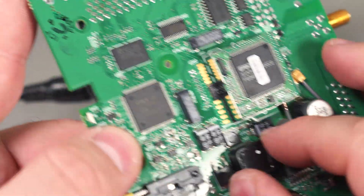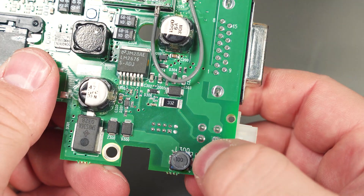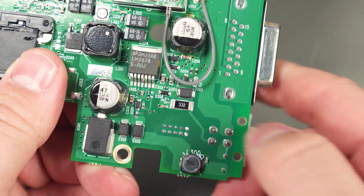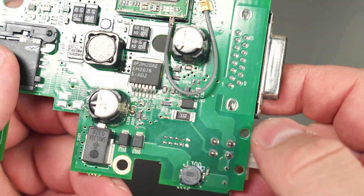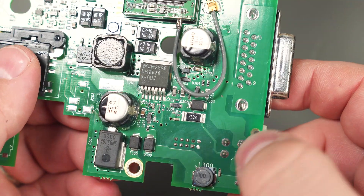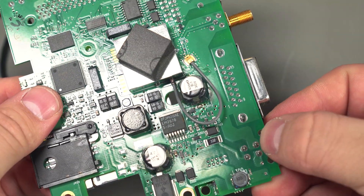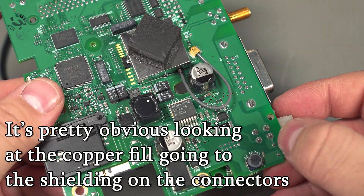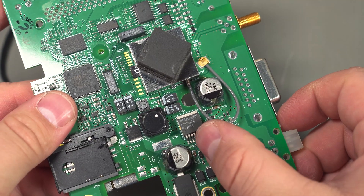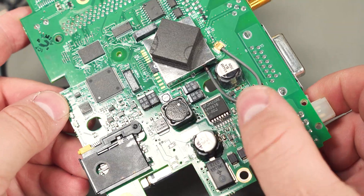They didn't put any hot glue on this inductor though. Looking at this, I'm going to assume these are power and ground. It looks like there's a sense cable of some type, because this trace does go over to this resistor. It looks like these are the actual power inputs. I've determined that this side is ground and this side has to be positive. Based on the fact that it's got this Texas Instruments simple switcher step-down voltage regulator, it should work with anything from 8 to 40 volts.